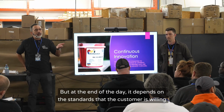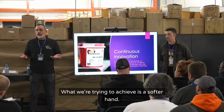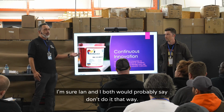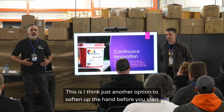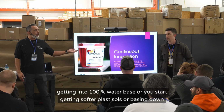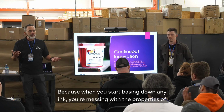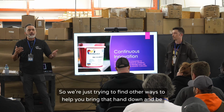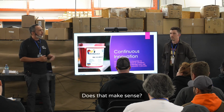Okay. But at the end of the day, it depends on the standards that the customer is willing to accept. What we're trying to achieve is a softer hand. At the end of the day, that's what we're trying to achieve. I'm sure Ian and I both would probably say, don't do it that way. I think this is just another option to soften up the hand before you start getting into 100% water base, or you start getting softer Plastisols or basing down the Plastisol. Because when you start basing down any ink, you're messing with the properties of the ink. So we're just trying to find other ways to help you bring that hand down and be softer. Does that make sense? Yeah.